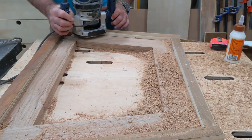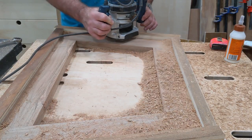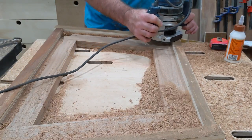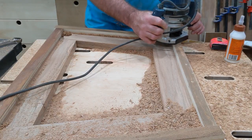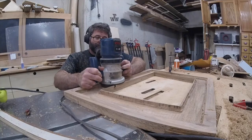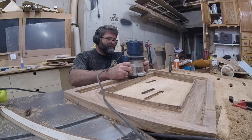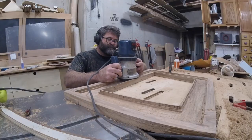Now the frame has the thickness I want, but I want the puzzle to sit inside the frame closer to the front. I attached some scrap plywood as a guide on the outside edge of the back of the frame, and I used a router with a pattern bit to give me a straight, consistent border. Then I remove the edge guides and begin to hog out the rest of the frame. I leave a lip on the inside edge so I can have a stable platform for the router — I'll get rid of that later.